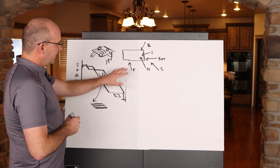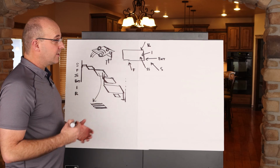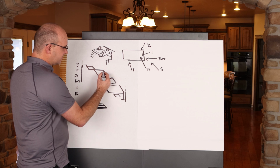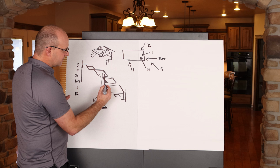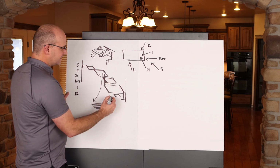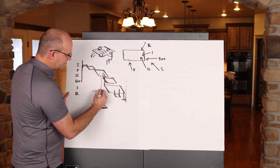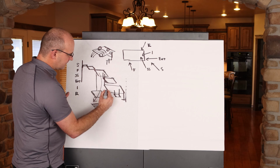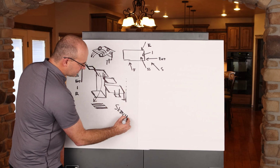Now the reason I want to sketch it out based on the phases is because now I know how things tie together, right? My superstructure is going to tie to my exterior. My superstructure is going to enable the interior of the building once the resources come down. How are these things tied together? What are the interdependencies here, right? And if, let's say, I had a different phase altogether, I can network that and see how that ties together as well throughout the schedule. So this sketch is absolutely huge.